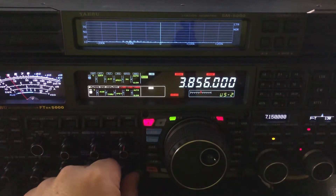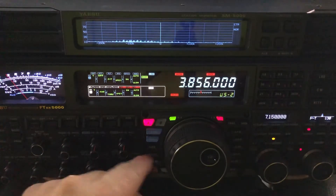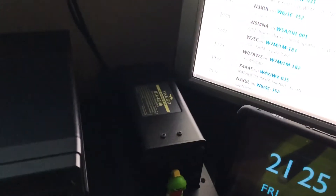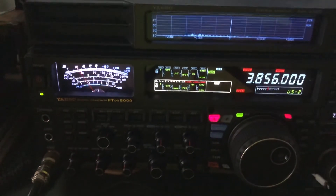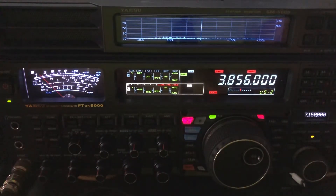It's a great addition to your radio. They're compatible with the FT-2000s, the FT-950, the FT-5000 here, and the FTdx-3000D can use a mu tuner. The FT-9000 comes with mu tuners built in. There's the mu tuner for 40, 60, and 80 meters — that's the one I'm using right now. There's another one over there; they daisy-chain, which is how they work.